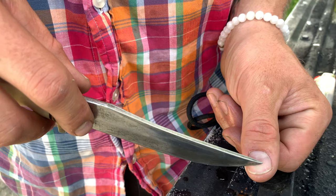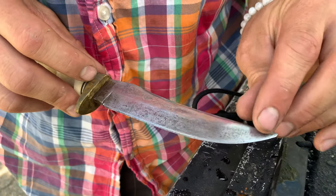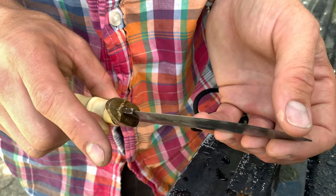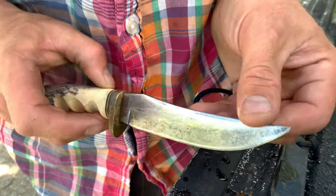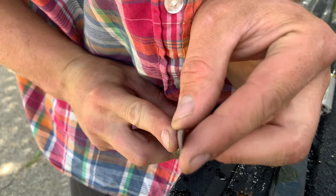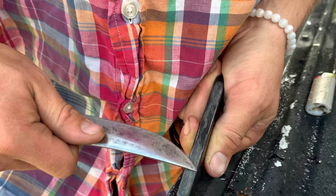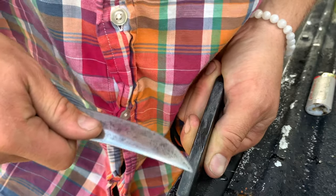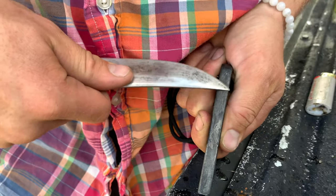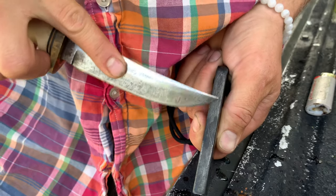Now I'm testing it on my thumb. I'm feeling where the edge has bite. I could also be testing with my finger pads. We're pretty sharp at this point — just this little bit up here at the tip. You can feel for the edge on one side and then on the other. It feels like it's non-existent on this side — just kind of try to imagine with your mind where the edge is. It might be rolled slightly to one side if the knife's been abused like this one. For that kind of scenario, I might do a little more of my grinding style sharpening, picking a rougher spot on my stone that still has marks from when I cut it on my rock saw.